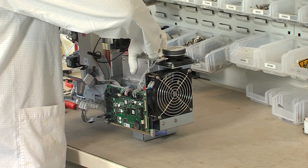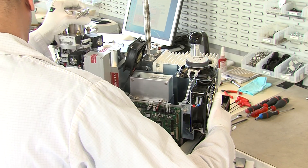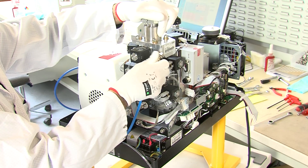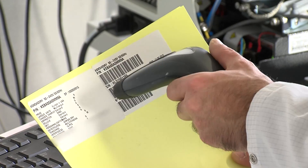First of all, the electrical elements are mounted. Then he installs the vacuum elements and analyzer cell, including primary and secondary pumps. All assembled parts of each mounted leak detector are registered, so we guarantee the complete traceability of the parts.